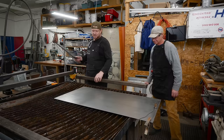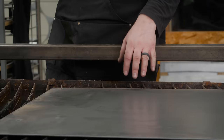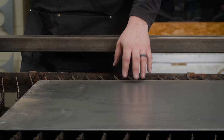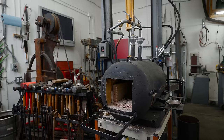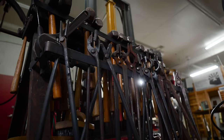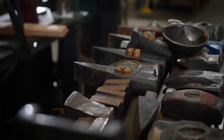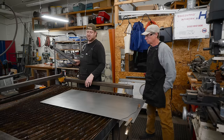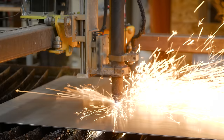This steel that we use is 12 gauge — a thickness that's not so thin that it transfers heat too quickly and burns, and thick enough that it doesn't warp. This is a form of mild carbon steel, about 0.31% carbon, which makes it malleable — that's what allows us to hammer it out, form it into shape, and use the press on it. It's the perfect material for cooking on as well; it holds the seasoning, and that's the most important part — giving our customers a really good finish that they can cook on.